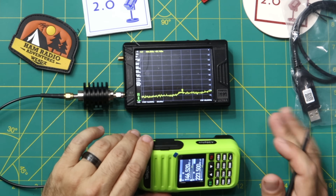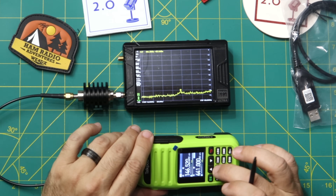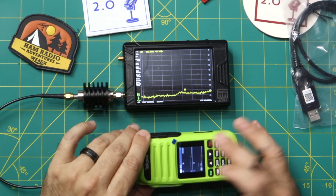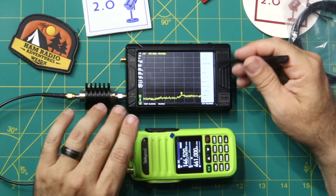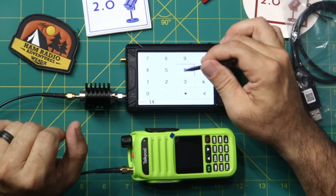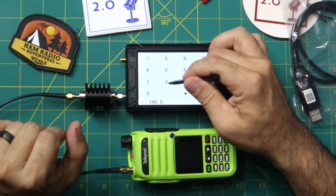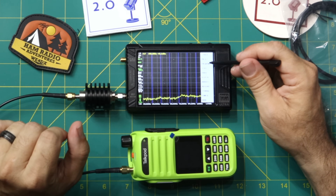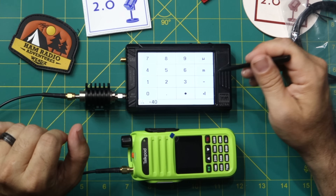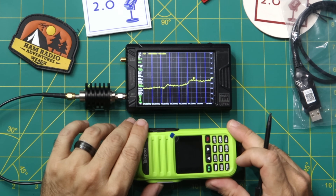This thing is wide open — it transmits just about everywhere. Going back to the top band, setting it to low power, then over to the TinySA: measure harmonic at 146.52 MHz. In the menu, setting level to minus 40 dBm, times-one attenuator.